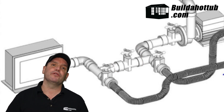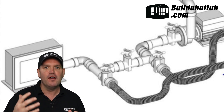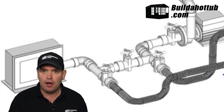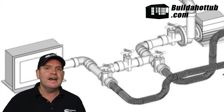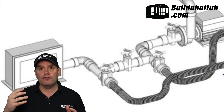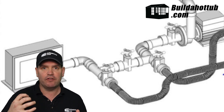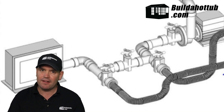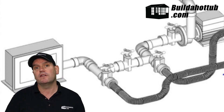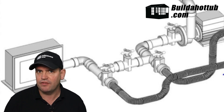There's no or not enough water going through the air source, the flow switches aren't kicking in, and the heater can't kick in because there's not enough water going through it. Make sure that gate valve is closed. The only reason you should be opening it is if you're on a single speed pump and on high speed you're getting too much flow through the air source — you can get an error for too much pressure, too much flow. You'd need to open that valve in the middle just to balance it and reduce the amount of water going through the air source, and that's only really when you're using the tub. I'd suggest closing it off fully when you're not so it's more efficient when it's heating.